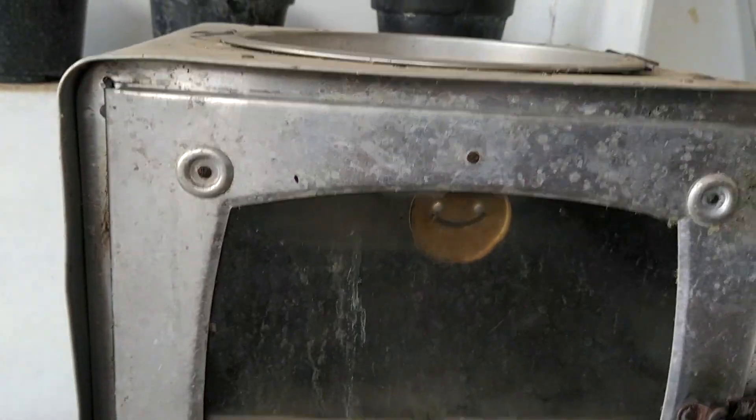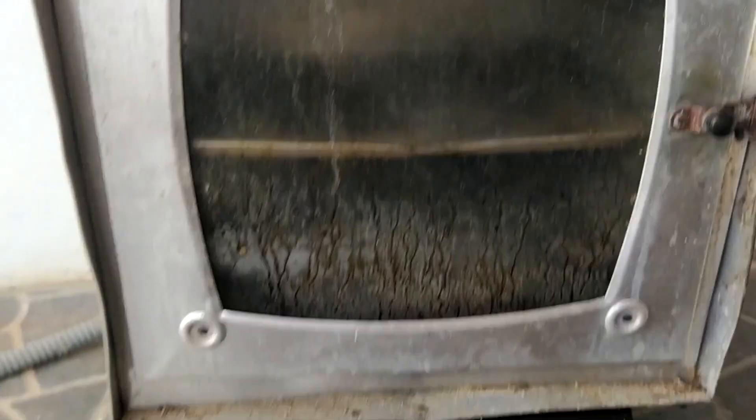Now the temperature — here is the funny part. Every number of plastic has a different melting point, because remember, we are not going to burn the plastic but to melt it. In our case, plastic number 2, HDPE, is going to melt around 130 degrees. Feel free to experiment, because this old stove has no indication of the real temperature, so I just turn it on and check with my eyes.